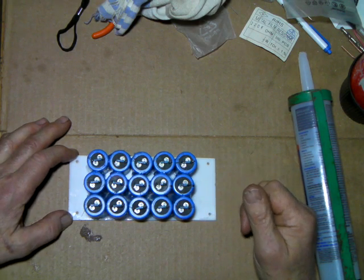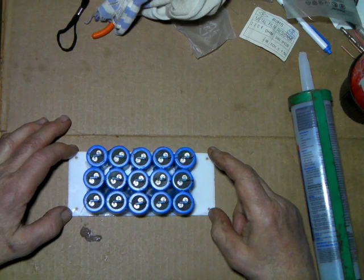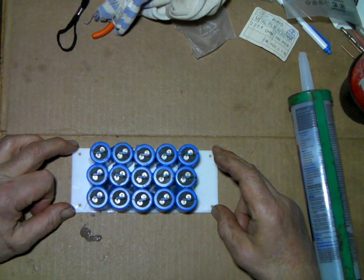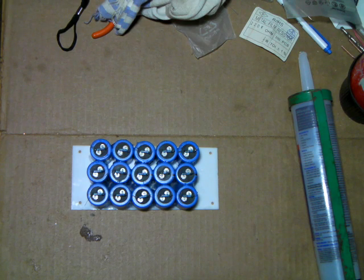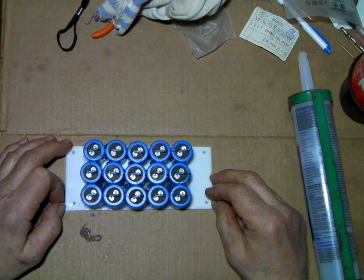The voltage rating is good enough for 2700 volts — or 2000 volts, whatever you need. We're going to be using this also for a 4CX250 amp, and I'll only be using 2000 volts. The next video, I'll work with voltage multiplying, doubling, and getting keying voltage — 24 volts — and bias voltage from a low voltage source like a small transformer. I'll also show you how to hook transformers in series to get the voltage you want, and maybe cover building the diode stack for the high voltage full wave bridge.